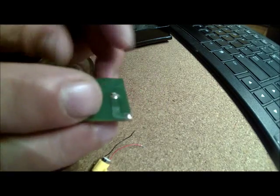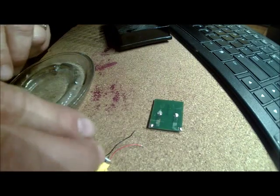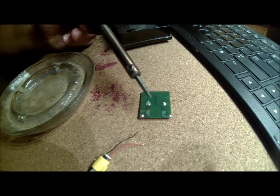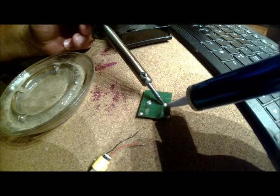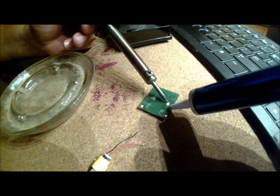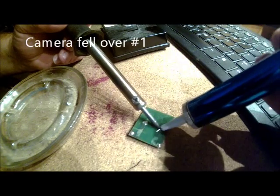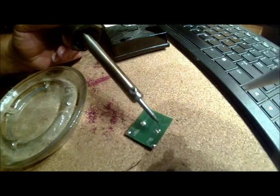After soldering we need to put silicone on to protect the joints. This time, unlike the manufacturer who put silicone right on top of the wires, we're going to run the silicone down the wire runs to keep the wires where they're supposed to be. So here we go — taking the soldering iron with the solder sucker triggered, reaching around. We need to make this hot and be careful not to leave it on too long.